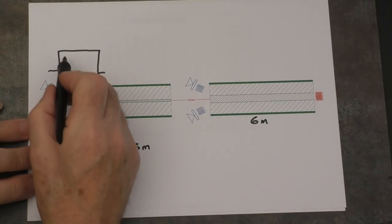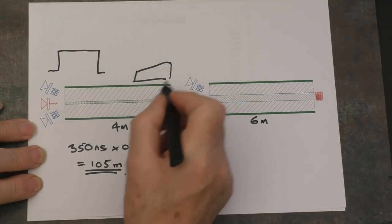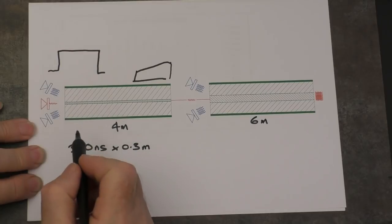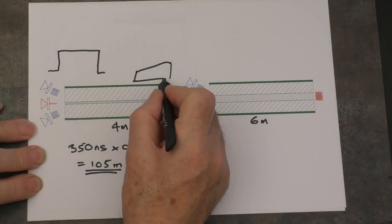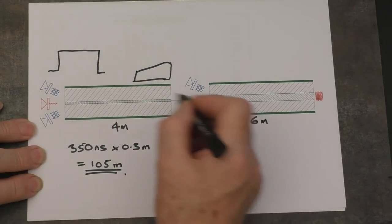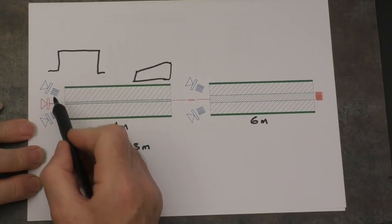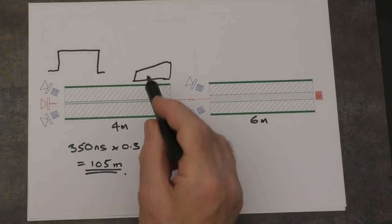So if I've got the physics wrong, perhaps somebody will tell me — but that's how it looks to me. That's how we can get these really weird shaped pulses: because the leading edge passes through and I only have a signal which sits there for 350 nanoseconds. The tail end of that pulse is going to collect a lot fewer photons than the leading edge, because presumably the pump laser is not working while the signal is working — though I don't know for sure. This clearly describes to me a mechanism by which we can generate these strange-looking pulses.